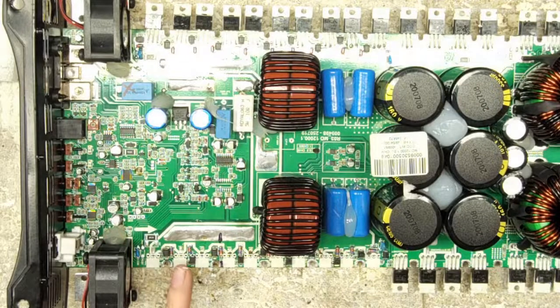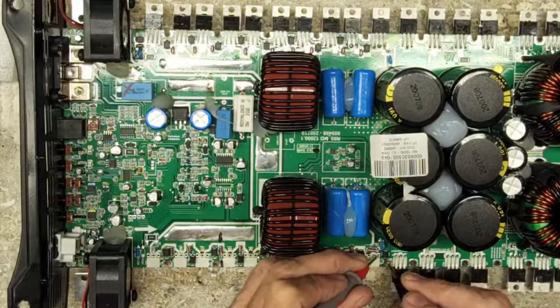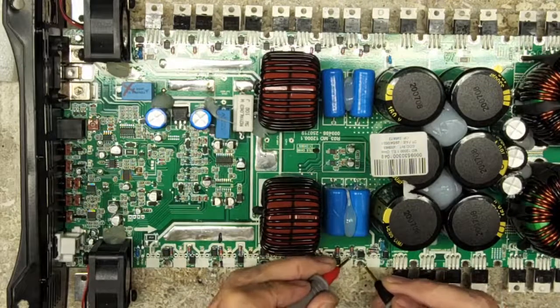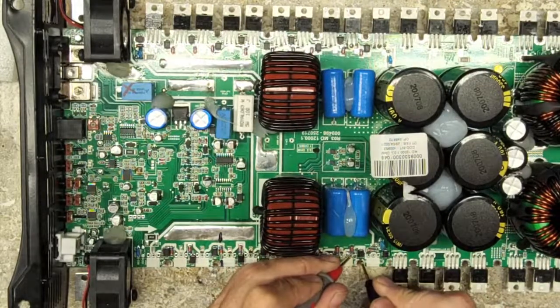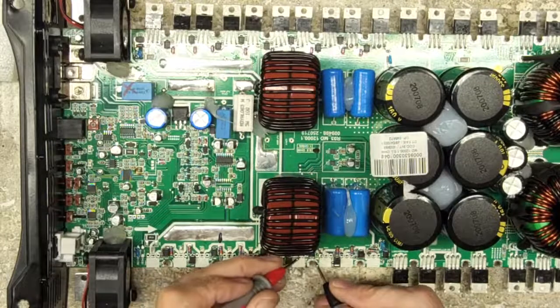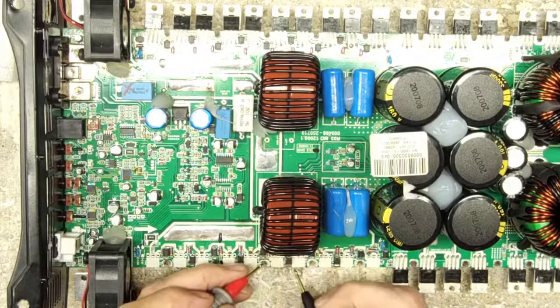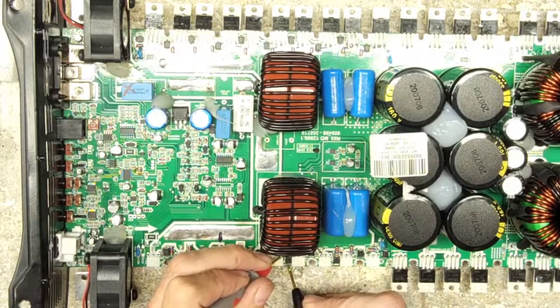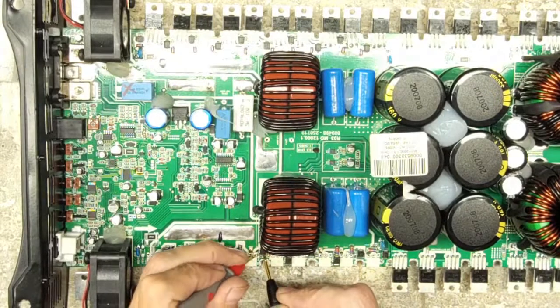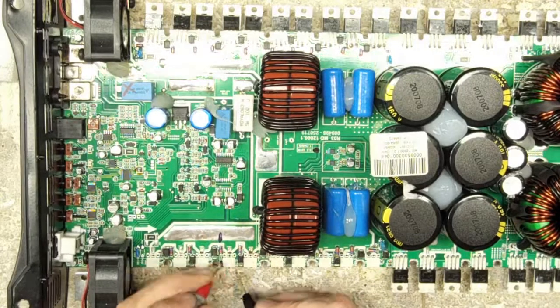The zeners are in, gate resistors are in. I should check to make sure I have good solder connections at the gate resistor, which, if you read from the gate pad to the backside of the gate diode, you should read each one. 4.9, yeah, they're 4.7 ohm resistors, but this UT161D has 0.2 ohms resistance in the leads. 4.9. Oh yeah, looking great. Looking fantastic.